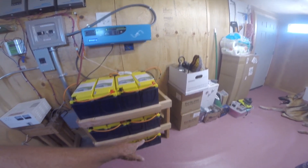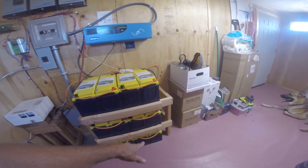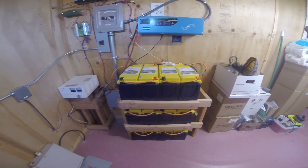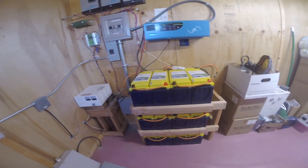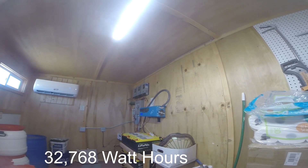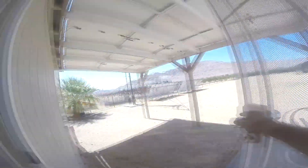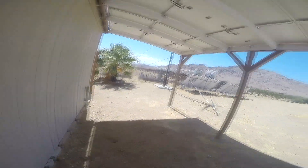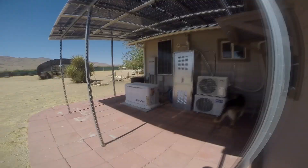As you can see we've got three banks — 200-amp 12-volt in series — so we've got 600 amps at 54 volts of batteries. There's a Generac — I think it's a 22K — it's on propane and it's automatic, so it's got an auto-transfer switch. I didn't install the Generac but I have worked on it because the original installer put it in before there was any solar here.